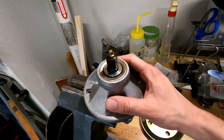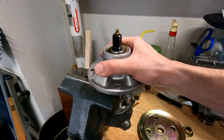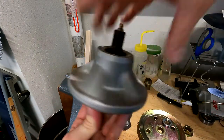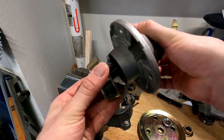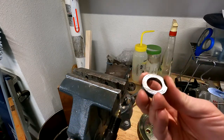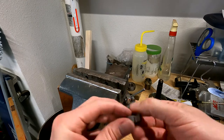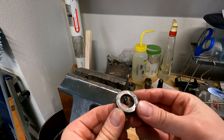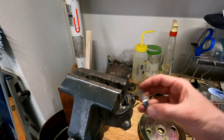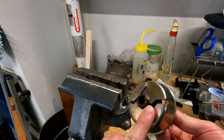On the Deere, as soon as I pulled it out of the vise, I was able to push the shaft out. Let's see if we can do that on this one. It's not even tight — very, very sloppy. Look at the bushing that came out. A seal is supposed to seal against this surface, and this is very rough. It's rusted and it's got weird tool marks on it. This is garbage — this is absolute garbage. The other one, other than the crummy surface finish, doesn't look too bad. I think this sat in water because it's rusted as well, and because the seals don't work, water got inside.